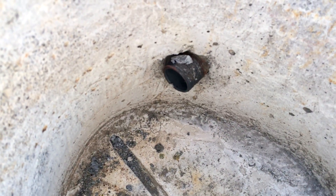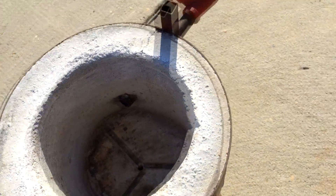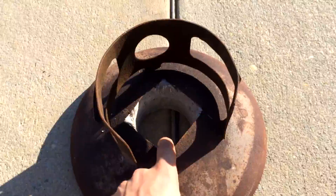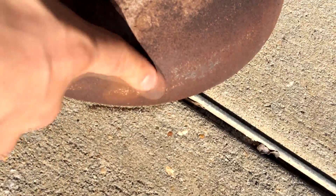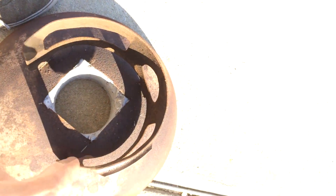The outlet for the torch comes in at an angle, which creates a swirl. When I cut the lid off, I used a planter's peanut can for this diameter and filled it with the same refractory concrete. Inside that, before I poured the concrete, there are actually four little metal rods. I welded them in and then ground them down flush — four rods that cut across it to hold the concrete in. Seems to work out fine.